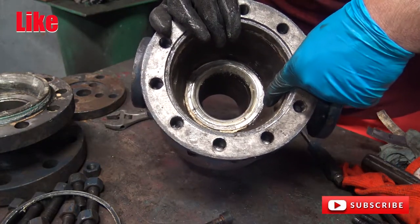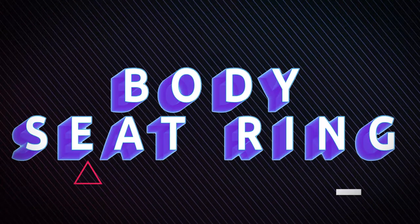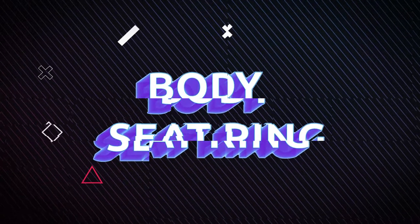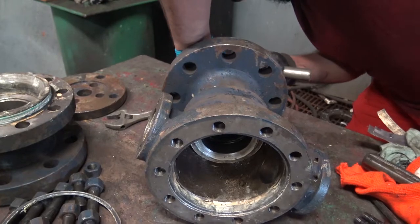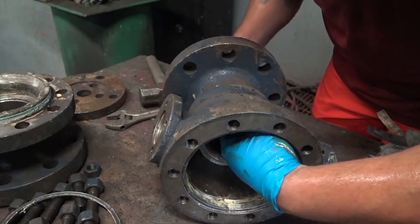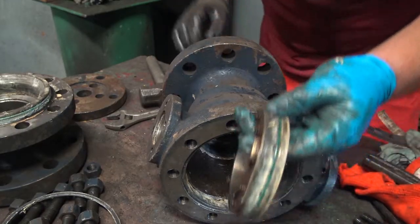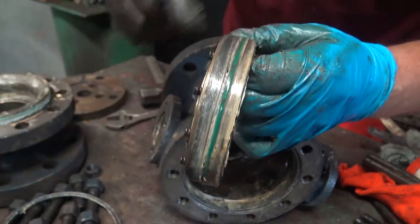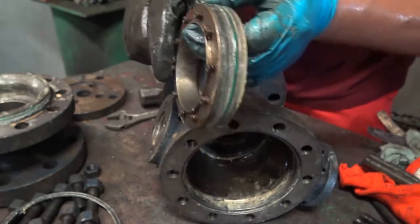All that's left is a seat — the body seat ring. To remove the body seat ring, simply push it away from the body, push it out. And there you have your seat, your body seat ring, which is similar to the adapter seat.